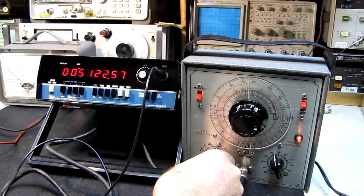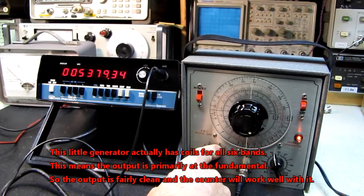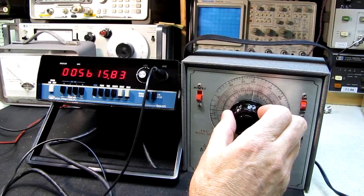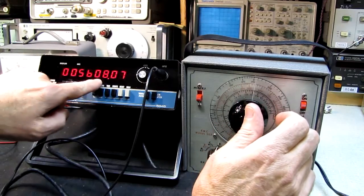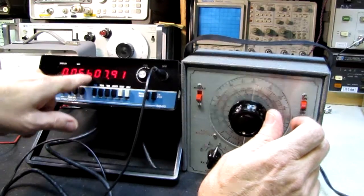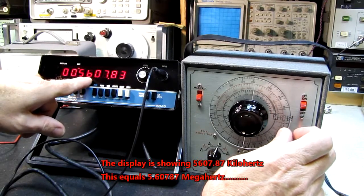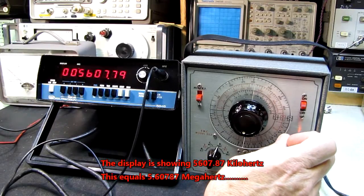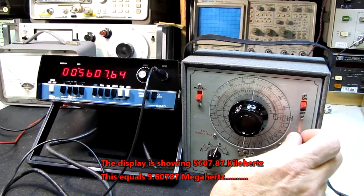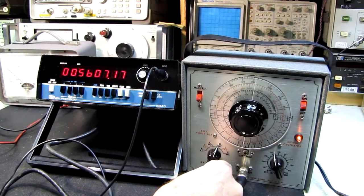Let's see how high this will go before it fails due to harmonics coming out of here. We're on band D — roughly 5.655 — there we go, 5.6 megahertz. Remember there's three more zeros here, so this would be 5.6 megahertz. You have to do the conversion in your head because this meter only reads in kilohertz, but that's absolutely fine for pairing up with this little signal generator. This is going to work out well.